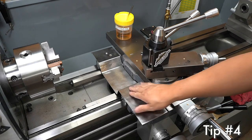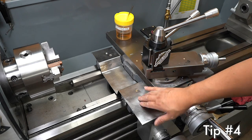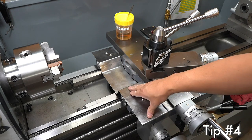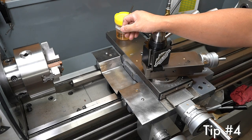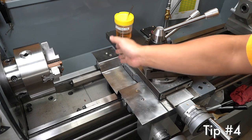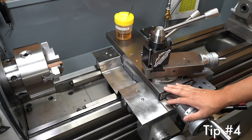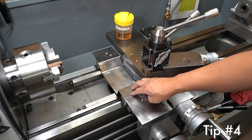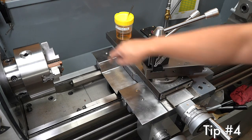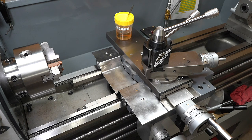If you don't already, consider making yourself a cover for your apron. This is simply made of 18-gauge sheet metal — you can use 18 or 20 gauge, buy it for a couple bucks, and just hand-bend it; you don't need any special tools. When you're turning, all the hot chips, cast iron, and everything won't fall directly onto your ways, and it prevents the paint and apron from getting damaged. It helps keep the chips off the ways so it's a lot easier to clean. It's just held on with a couple of 10-24 screws, and I drilled holes for the ball oilers. You might want to make one for your lathe.